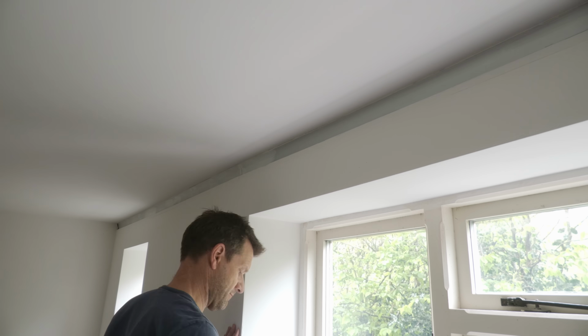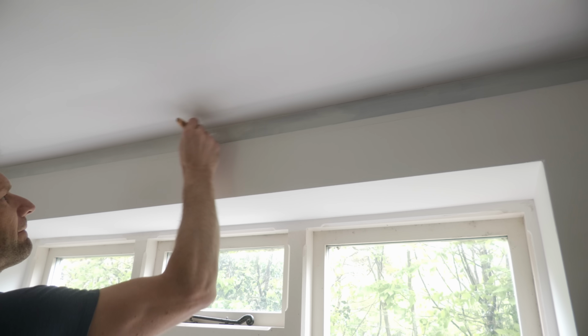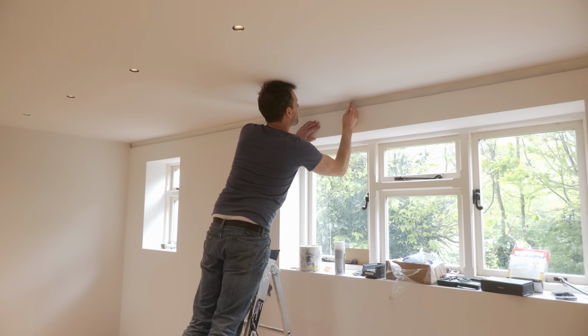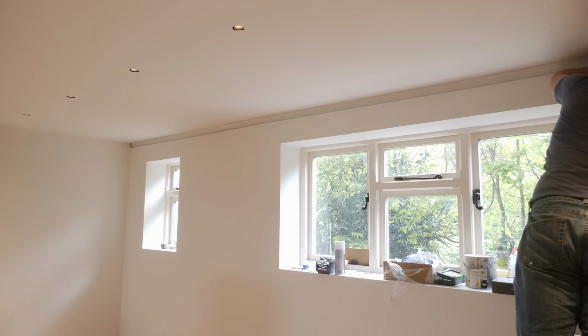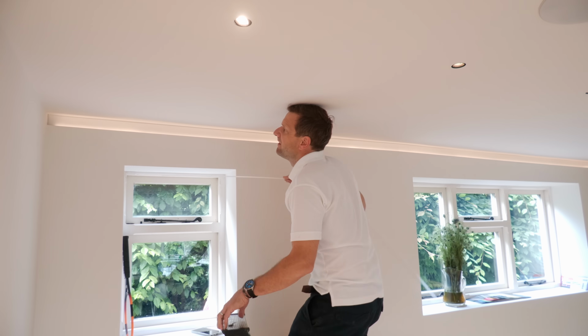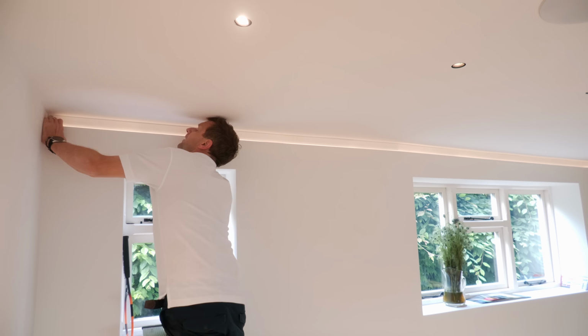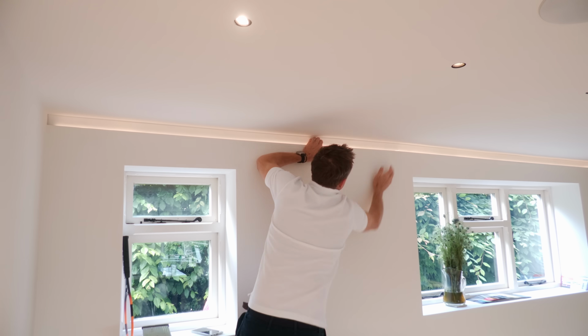I primed the profile with Zinsser bin. I wish I'd pre-sprayed it with cover stain, but well, that just didn't happen. I then applied multiple coats of emulsion because I haven't got metal paint in a tint to match the walls, and also, as I said, because the emulsion guarantees the same colour and texture as the walls. I used the same connectors as with the others, and finally it was on with the diffuser. As you can see, it doesn't make a massive difference as the light is so well spread by the profile, but it will at least keep dust off the LED strip.